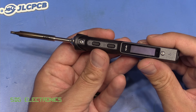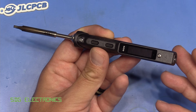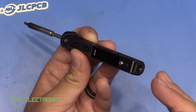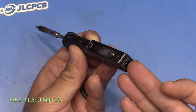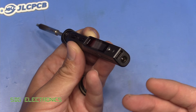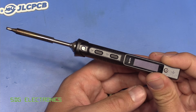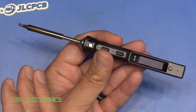Overall I think it's a really quite nice soldering iron. It does work very well, but in my eyes this is more geared towards portable soldering than benchtop use. Because of the various power options it has a lot of flexibility — you can power it from a phone charger, a USB-C power bank, a DC adapter, your car, or a battery pack. There's a whole variety of power options which means you can take this anywhere and get very good soldering results.